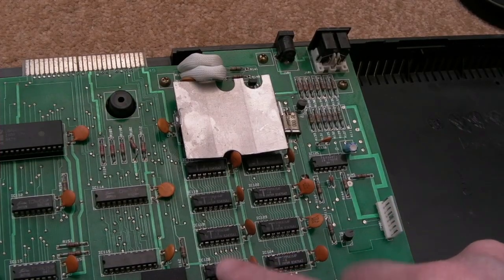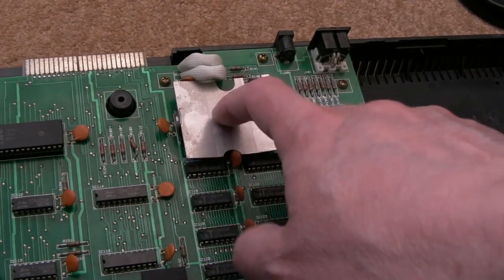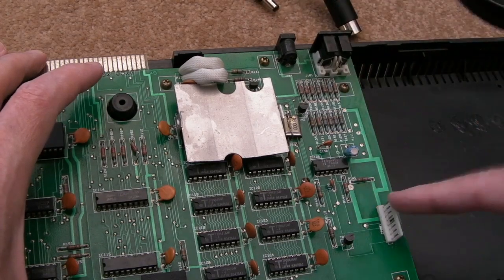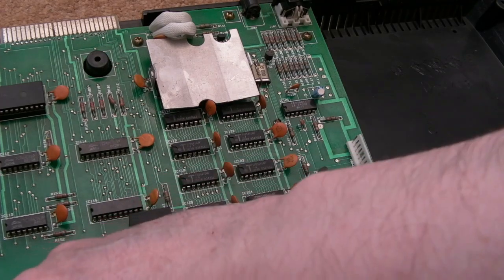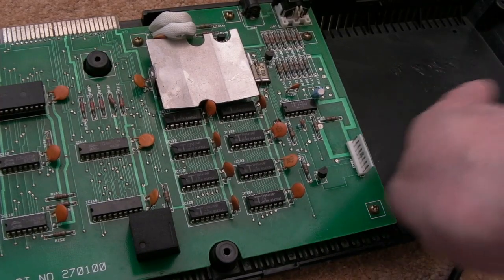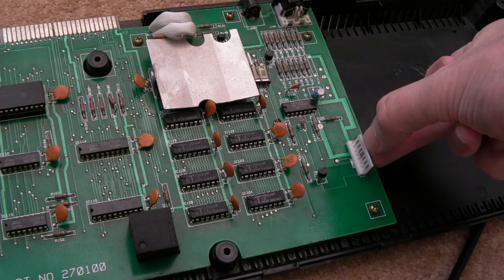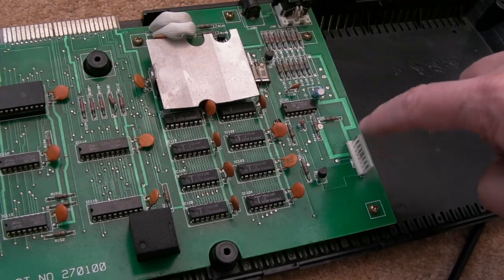Anyway, the next thing I'm going to do is just test the temperature of these. We can access all 8 of those there without taking that off. Let's just connect the power up. I'm not sure if the power switch is... Yeah, the power switch needs to be connected here. I think, and this is something I learned from watching Yellow Belly himself actually, on some of these boards like this one here, the power comes from the tape side, from the right over there, the power switch, it's not the back up there, that's the difference. And using a DuPont connector, you can just connect pin 1 there to pin 3, I believe, and that will switch it on.